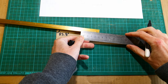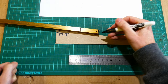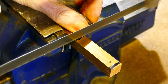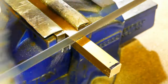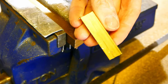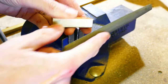First I'm going to cut off a piece of the brass, slightly oversize, with the angled ends cut roughly to shape. I'm cutting off the blank using my hacksaw. I'm filing the burrs away ready for holding the part in the machine vise in the milling machine.